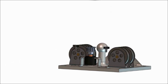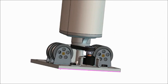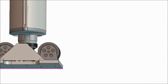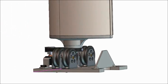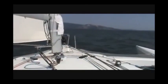The offset of the mast is transferred to the sensor via a rubber timing belt, which is easily slipped into place when the mast is raised. The angle information of the mast sensor is used to correct the measured wind angle from the wind vane sensor at the top of the rotating mast, enabling valuable wind speed and direction information to be presented on the RM20 cockpit-mounted display.